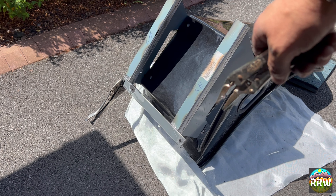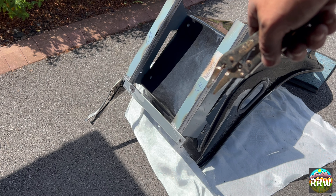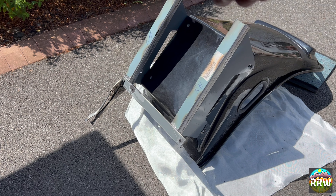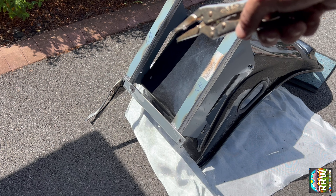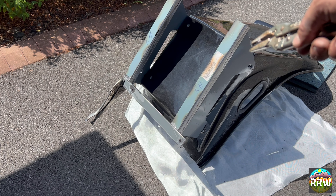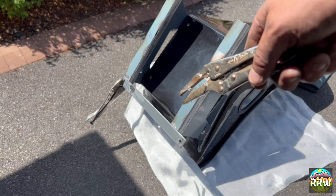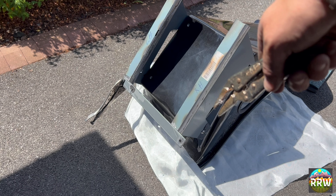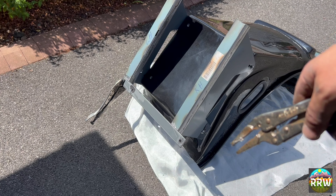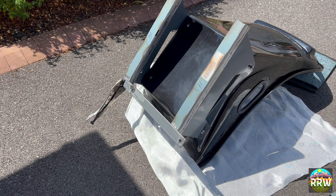Right, so they are now all mounted to the seat bracket, and I'll offer that in the car to find the best seating position and then tack this bad boy in place - that's the plan. So what I'm doing here is fabricating a plate that comes across, and then basically I'm going to weld that plate into the car. That way I can get the seat further across to the tunnel, giving my clutch leg as straight as possible, and then obviously the biggest distance from the door to the right hand side of the seat - which is the off side, the driver's door area. I want as much gap here as possible, so I'm sliding that across. I'm going to weld this bracket in and I've got some holes there which I can weld through to the floor.